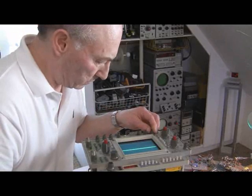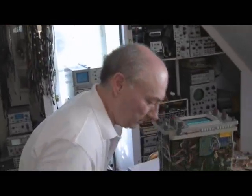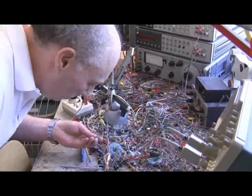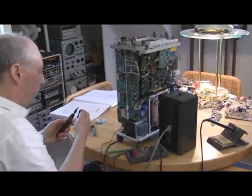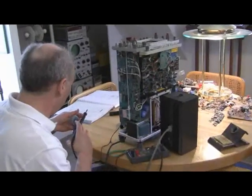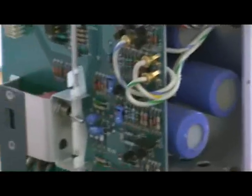The question is, are we going to give Mr. Osborne a new tantalum capacitor gratis? Considering what he did for the world, I guess we sort of have to. We poke around the inventory and look for something around 15 microfarads at 20 volts — it's not tantalum, but it'll do. This is for Tom Osborne; this is his reward for getting HP into the computational business. Clean out the PC holes — back when boards had PC holes.